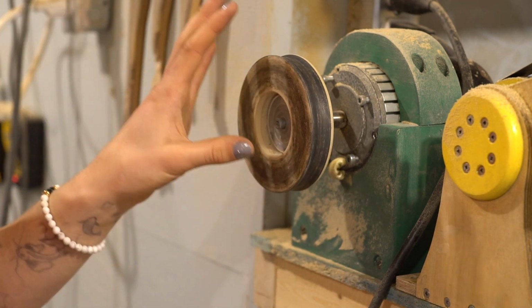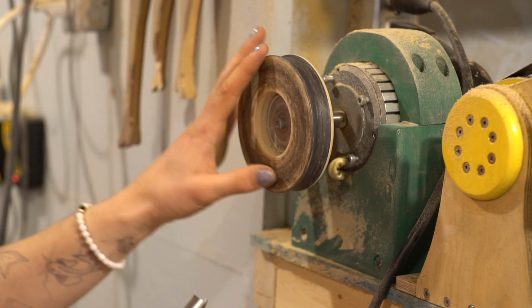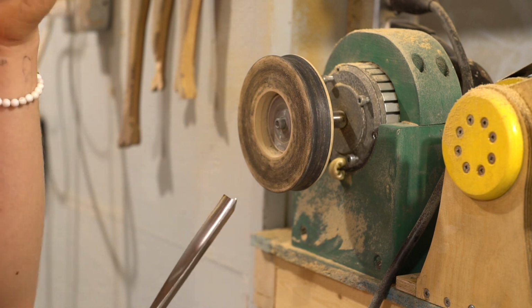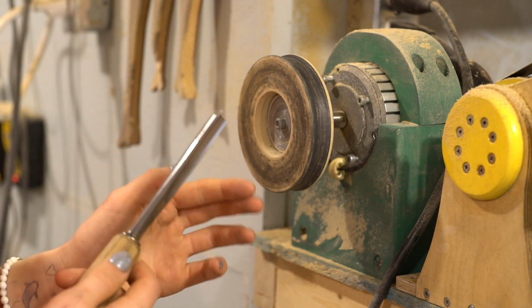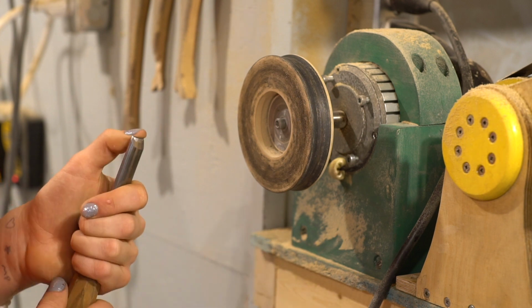This works really well with a fairly fast RPM, so I think this spins between 2,000 to 3,000 RPM, which is your typical bench grinder, and it works great, and it doesn't heat up too much as long as you're not removing too much material. So you just touch it on there for 10 seconds and nothing's going to heat up, which is really nice.